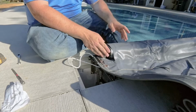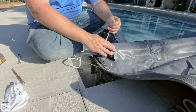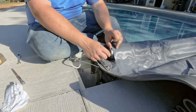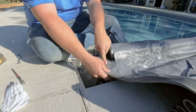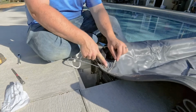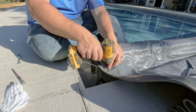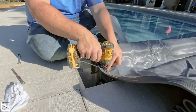The next step we're gonna do is we're gonna use our bonding wire. We're gonna attach our bonding wire and our cover, and we're gonna pin all that to our leading edge bar, okay? Before we get to that, I like to make this bond wire look a little cleaner, so I like to put this bond wire under this 2-hole plate here. So to do that, we're gonna loosen up one, and we're gonna take our other screw all the way out.